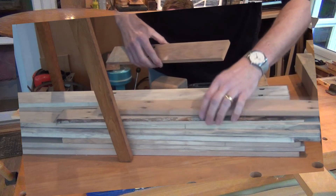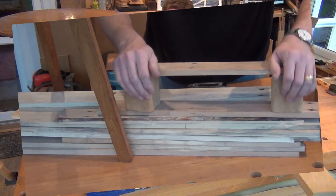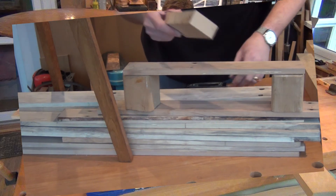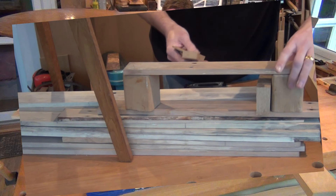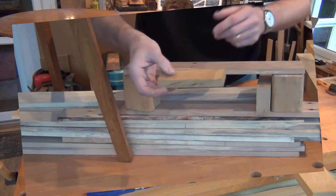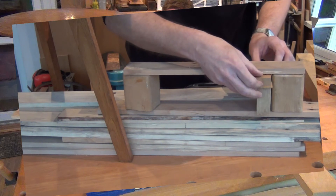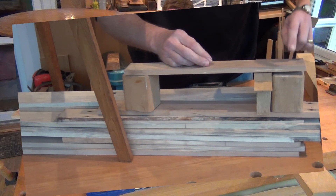So let's assume that's a bottom slat, a couple of blocks, and that's the top slat. Now you can go at that with a wrecking bar, a large hammer, circular saw or jigsaw. But I find a much easier way and less destructive to the wood is to use a hardwood block and a couple of hardwood wedges. I place the block next to one of the blocking pieces in the pallet. And the two wedges, one on top of the other, like so. If I push those against each other, this space here widens up. So how I'm going to remove this is to put the wedges in and then push each wedge in the opposite direction — and that will force the slat off the block.